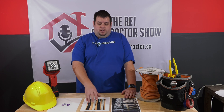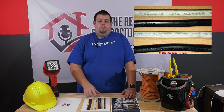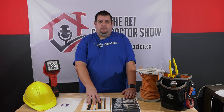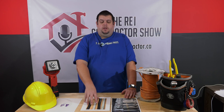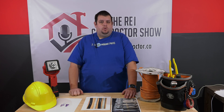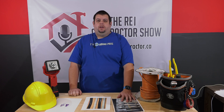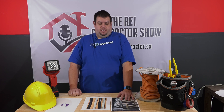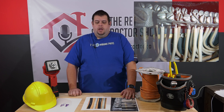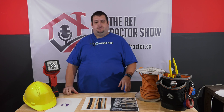To identify it, as you see right here, we have this white wire and it's clearly marked aluminum wiring. Most people don't realize that all modern wiring has a date stamp, and that's very important — you can tell whether it's aluminum or copper. If you see AL, that's aluminum; CU is copper, but most of the time it's written out in full. And as you'll see in this picture, you can see the connections in a neutral bar with a silver aluminum-looking wire to make it real easy. You'll also notice the cable feels a lot bigger on the outside because of that gauge upsizing.